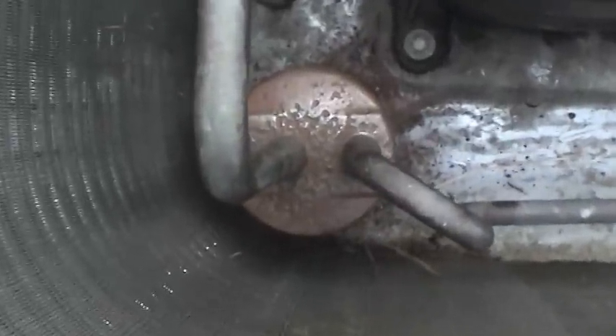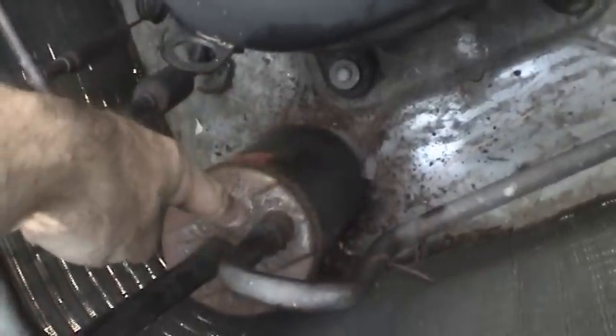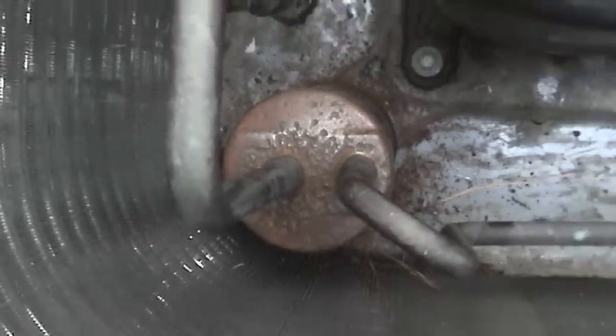I think I've got this thing prepped up as best I can, and you can just see the level of damage that being outside for 20 years has done to that accumulator. Failure of this accumulator is imminent — it's an absolute certainty, it's going to happen — but hopefully we can control when it happens and be prepared for it. It's designed very well and very thick, so I've got a lot more material to go through before I actually start having a leak. Nine times out of ten they start leaking on the bottom versus the top, and the bottom is still kind of wet, so maybe I can put some grease under there in the wintertime. This thing is all ready to have the coating put on and hopefully get a little more life out of it, or at least defer some of the costs.